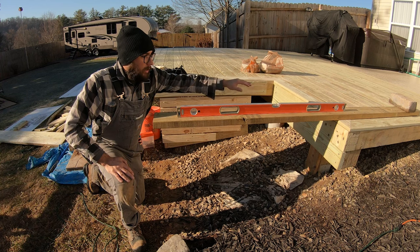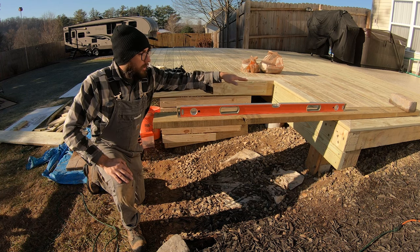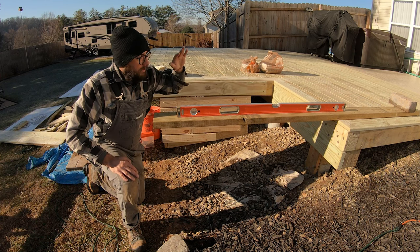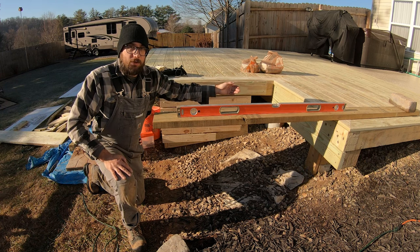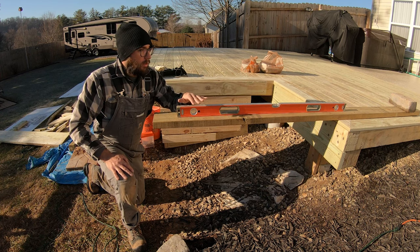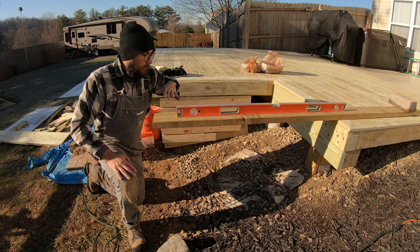If you're not done with your framing yet, make sure you put something to establish that height and where that final grade is going to be. In this case it's going to be on the decking boards. I take either a piece of wood like this, or if it's a really long run, I'll take a string and run that out. You always want to level out from that as far as you think you're going to go for this finish height.